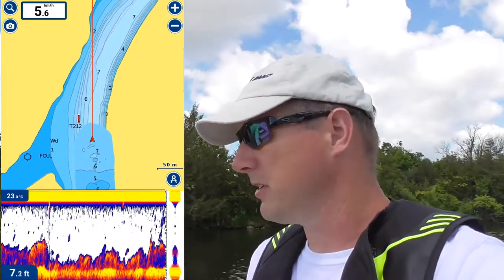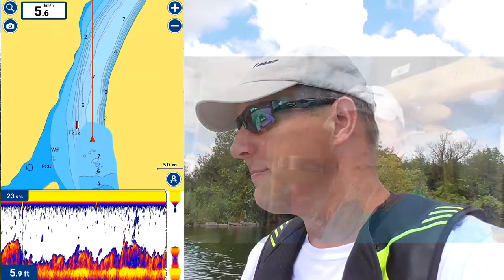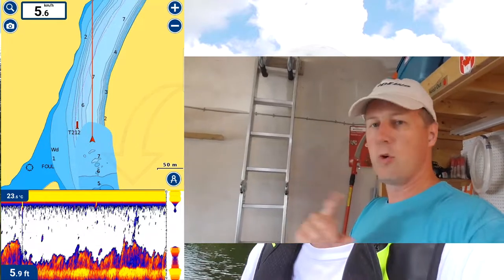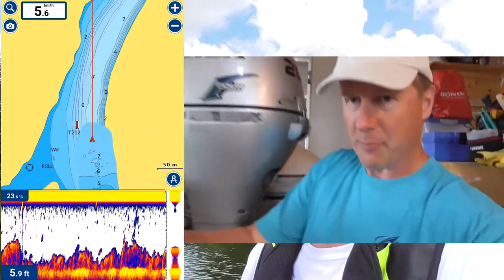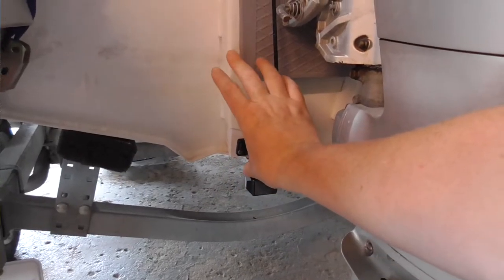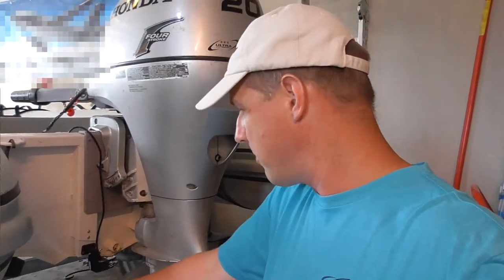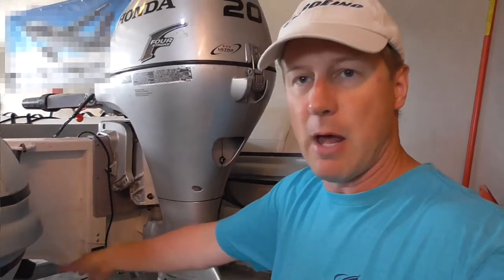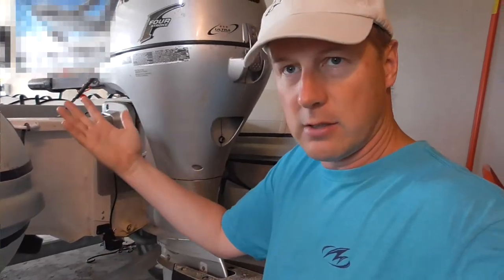The bottom contour is showing — I'm not a fisherman; it's in fish finder mode. I'll have to talk to some fishing buddies about the gain option. I'm going to pause the video here quick. You can see that noise across the top of the screen. After a little research and talking to friends with fish finders, the answer is that the transducer is only about four to five inches below the waterline on this boat, whereas the manual recommends eight to ten inches. What's likely happening is the sonar is bouncing up to the surface and creating that noise at the surface level. It would be interesting to see the difference on a larger boat where the transducer sits a foot or two deeper.